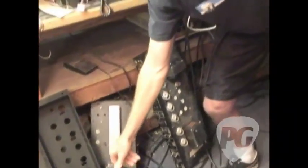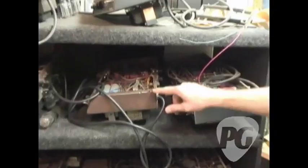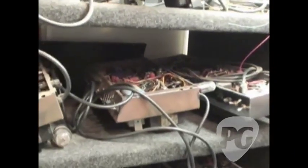This room is kind of unique. It is where some of the magic happens, but I'd say the magic might be more obvious upstairs in the tone lounge, where Doug and Randy play through the amplifiers and make tweaks to the circuit. When he comes down here, he's got the amplifier on the bench running through the scope, meters, and testing voltages. This is a great resting place of a bunch of history of previous designs and ultimately future designs as well. A great reference point: this is the first prototype of the dual rectifier. There's a rectifier tube here and one underneath, and right next to it is what was ultimately the first straight front panel chassis for dual rectifiers — whereas this obviously looks very similar to a Mark IV chassis.